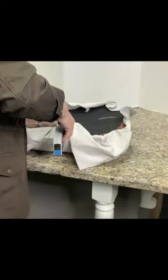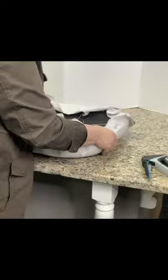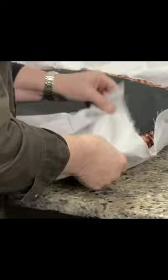Now that you have it all in place, you can turn it over and make sure you like what you've got going on. Now we've got to finish it off — the front's the most important part. You've got to get into the wood of the chair. What you want to do is find the center between the two staples you've placed, because the front is what we want to look great. Keep separating, finding the middle. I've got a staple here and a staple here — I want to ease it in all the way around. Just keep splitting the difference.